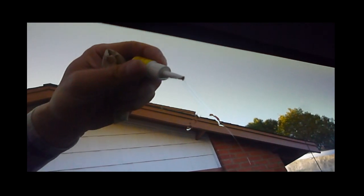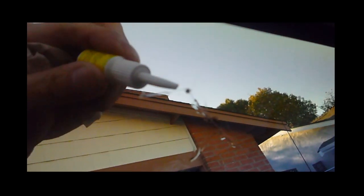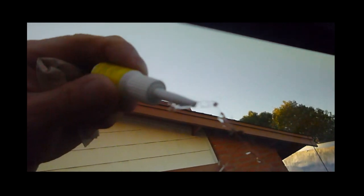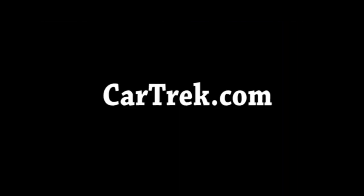When we finish, I want to show people here — I drilled a hole here, and this hole still isn't filled. And this actually extended the crack because of drilling this hole. So be careful when you drill holes and make sure the crack doesn't extend. You can see this section from here to here is because I drilled the hole at this point. Drilling the hole made the crack bigger — yeah, the crack is now longer from here to here just because of me. I made this worse.